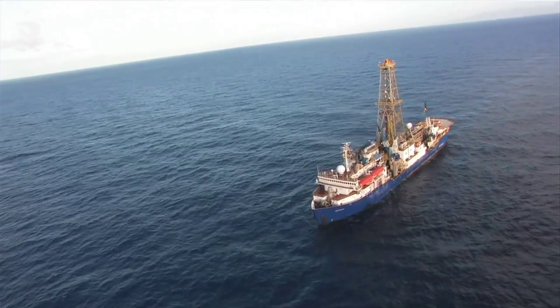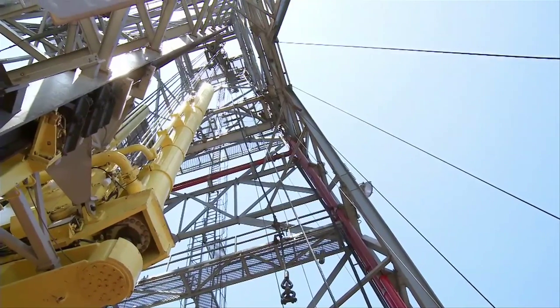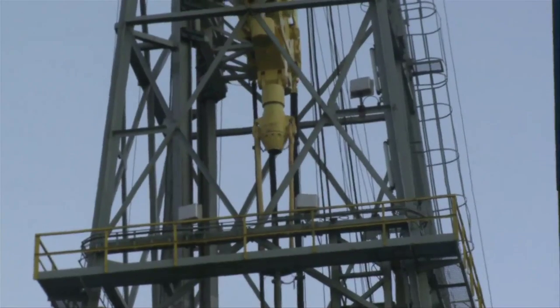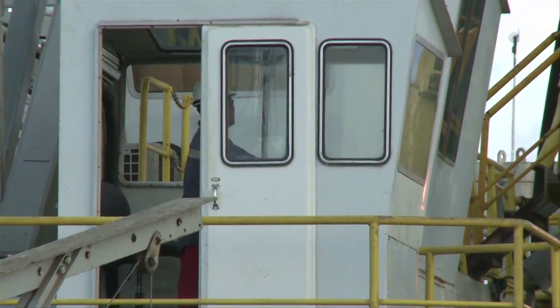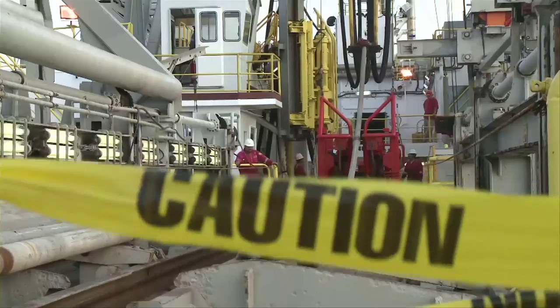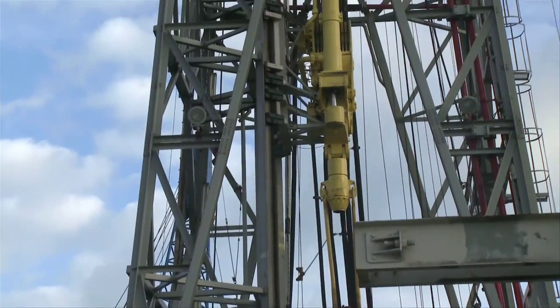This is a real deep water drill ship, so we have a lot of heavy tools and high weights that we operate with. The derrick is 193 feet off the waterline and it's rated for 1.2 million pounds. Over there you'll see the big long skate area — that's where our pipe racker is. This ship is quite different than most modern drill ships in that we have a horizontal pipe racker. Most new ships have vertical rackers for all of their pipe. One of the reasons we do it this way is that it's very efficient and very fast. We can trip pipe nominally 25 stands per hour.